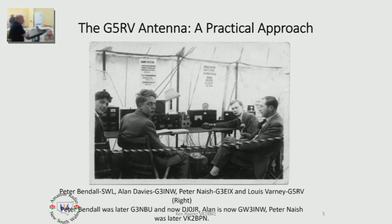The end sixth of the antenna length is not doing a huge amount, and can actually be dog-legged. I've dog-legged these things without any problems at all. So it goes up in the trees. It's sitting probably about 25 metres anyway, up in the air. I get it up there using a bow and arrow.